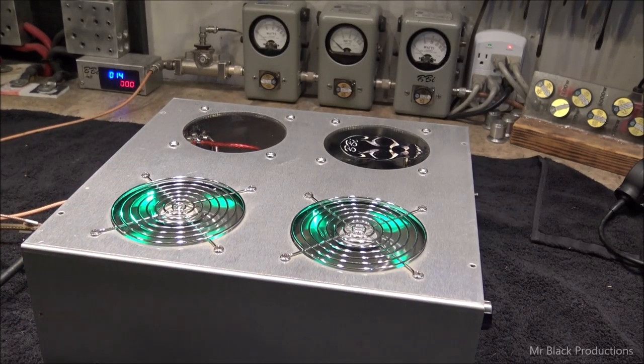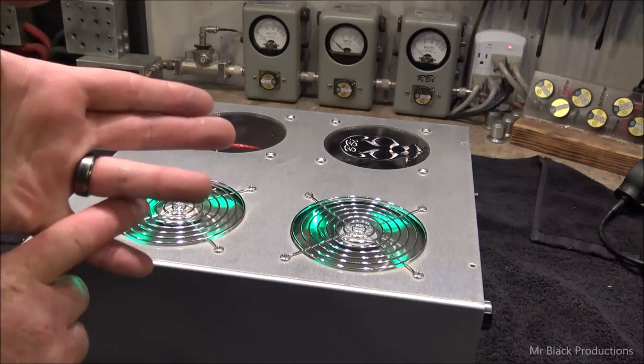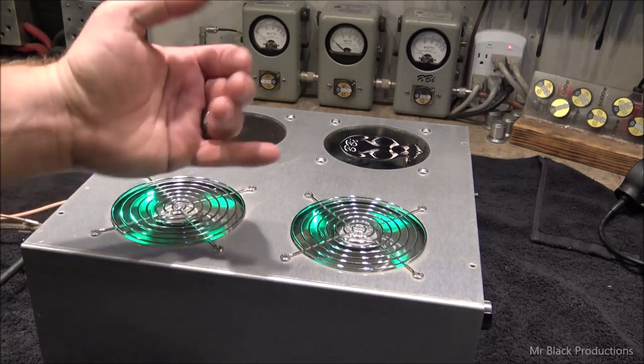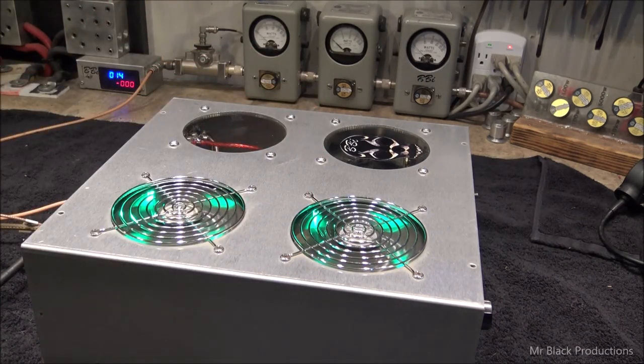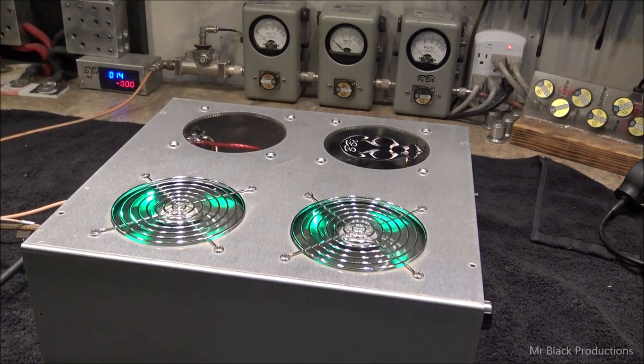So that means, to you on the other end, you want to make sure you've got this hooked up to a very substantial 110 volt outlet. Right now I've got it hooked up to a committed 15 amp outlet. There's nothing else attached to it. So we don't want our radio power supply, four computers, six TVs, 14 lights, a partridge in a pear tree, all plugged into the same outlet or the same circuit for the room. Keep that in mind. And this thing will last you forever, especially on sideband, because remember, it's going to pull more out of the wall on sideband.